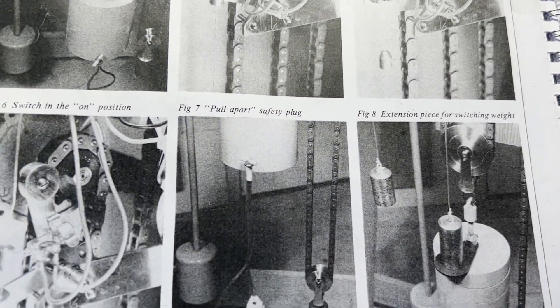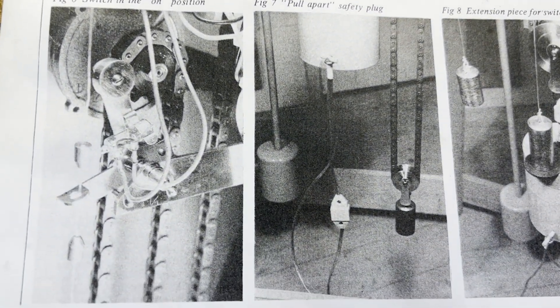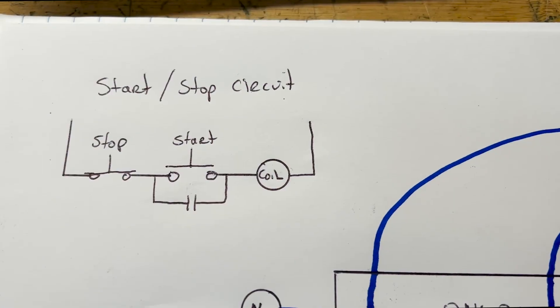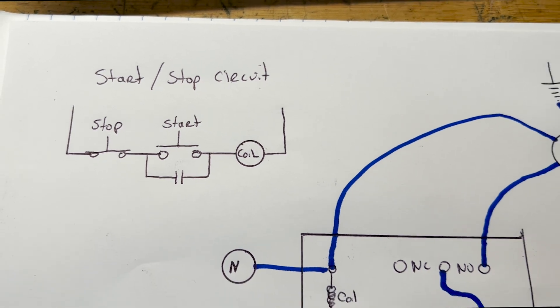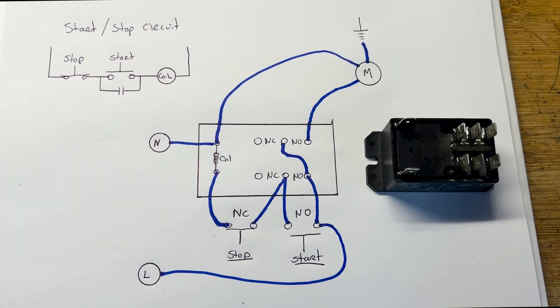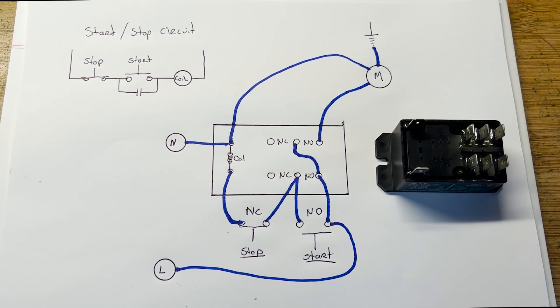You can see here in the pictures — he has quite a complex little mechanism to turn this thing on and off, so a lot of parts and pieces would need to be made. So I went back to the basics and looked at a simple stop-start circuit, had a relay here — a motor starter relay — and figured out how to wire this thing out.